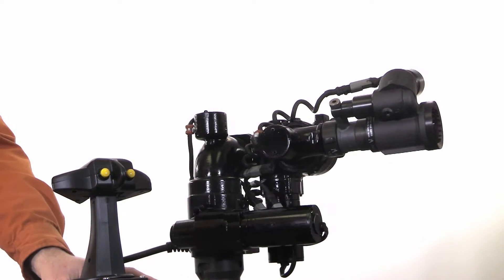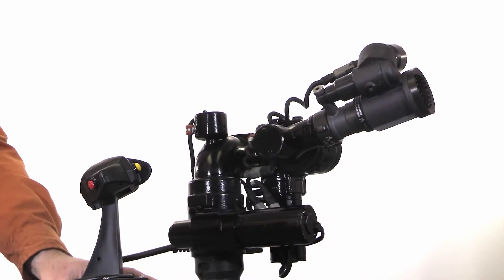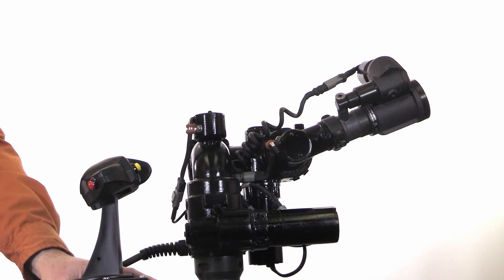And when you let go of the joystick, the monitor stops. With Point Aim technology, you can point the joystick to the desired target position, let go of the palm grip, and the monitor aims itself by synchronizing to the joystick position. Any point in the monitor's operational area can be reached automatically without having to pre-program attack positions or hold onto the joystick while the monitor moves.